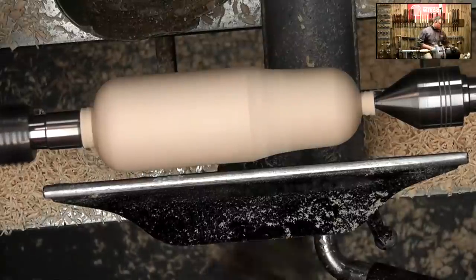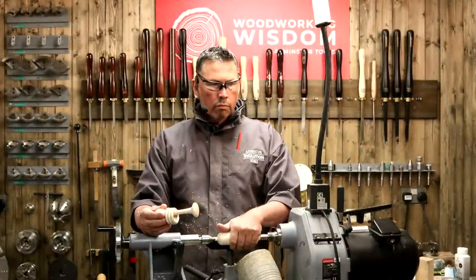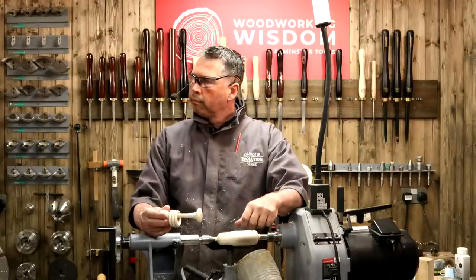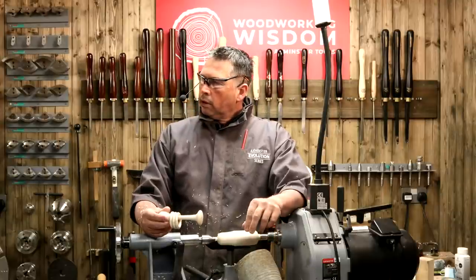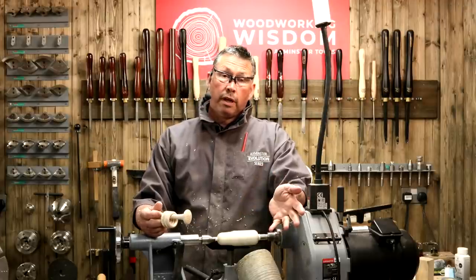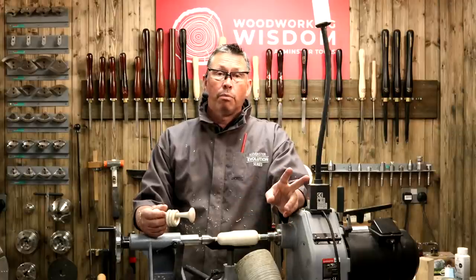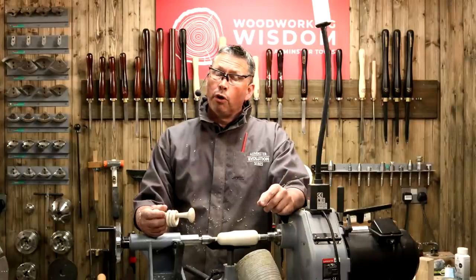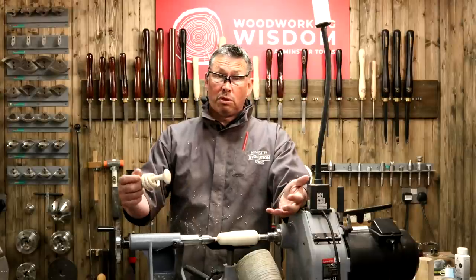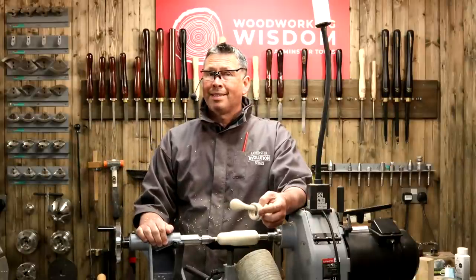Yes, Steph. So we've got a question from James Mason here. It's a general question about lathes. He hasn't bought a wood turning lathe yet, but he's looking at the Axminster ones, and even the AT350 is only 400 mil between centres. Is that enough? He's seen some on eBay that are 1,000 mil between centres. Yeah, so if you're looking at a craft machine, and I can't remember what the code for it is, but we do a floor standing 1100 between centers. So that might be worth a look. But most of the benchtop machines also have a bed extension. So it might be worth having a look at that, because that will double the bed length for you. Look for the bed extensions as well.